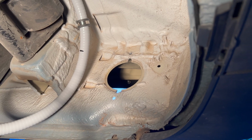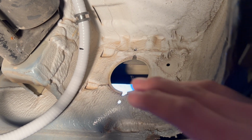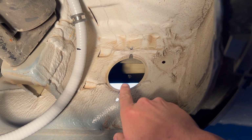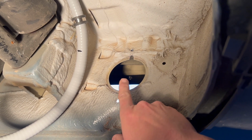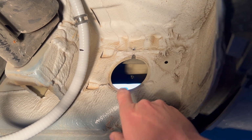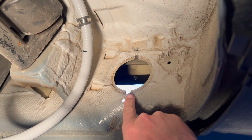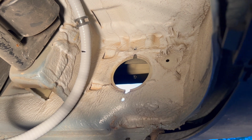This is looking up behind the rear locker. There's normally a 3-inch factory dust cover here, and I'm going to utilize this hole to minimize the amount of cutting. The daylight you can see is from our custom locker boxes on the outside, more on that later. I've drilled holes for mounting a box here and then had to file a couple of little notches for the actual plug screws.